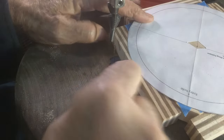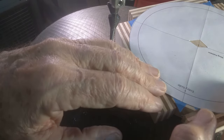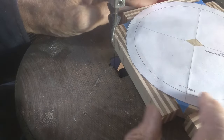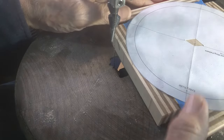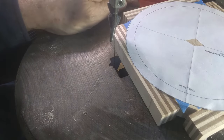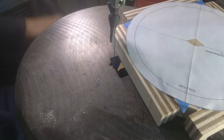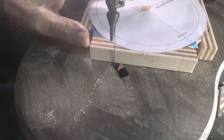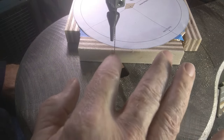I've got the pattern applied where I want to cut all the way around. Hopefully it's going to come out pretty much the same on each one of those blocks - you've got eight of them. It said to use repositional glue, and everything I use is repositional, but it doesn't always work properly because you've got to pull this pattern off, glue your accent rings with maple on each side, trim each outside, and then reapply and cut the inside. I've made two patterns just in case. I'm going to cut this outer one with no angle - a 90 degree cut straight up and down.